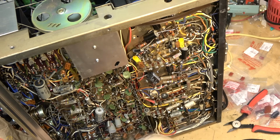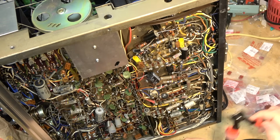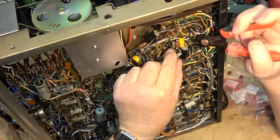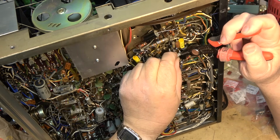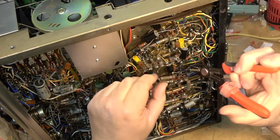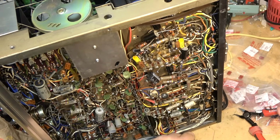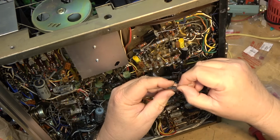Whereas the modern tube amps that use thin film resistors don't have that issue with them warming up and the sound changing. And that's really the reason why I'm not using my Mac. Also the fact that I don't want to burn up the tubes any faster, because they're unobtainium, some of them, right?